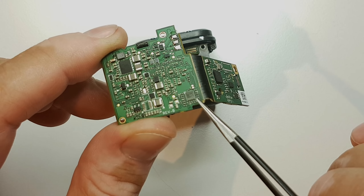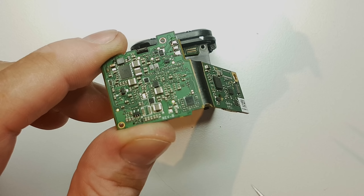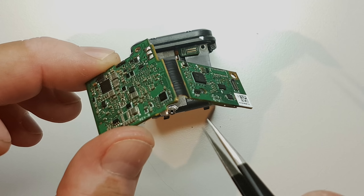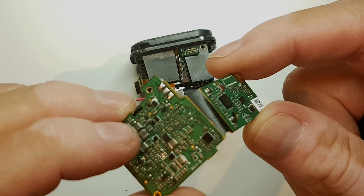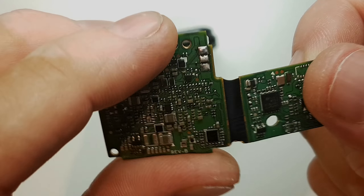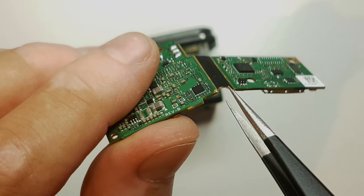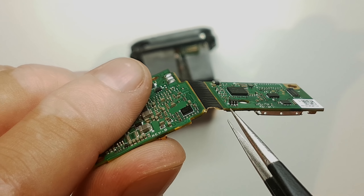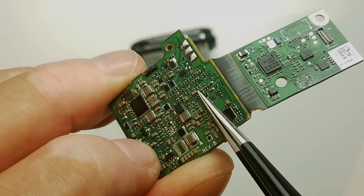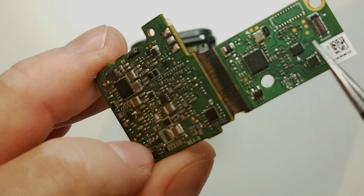But the only thing that was not broken or killed was my lucky part here. This one is actually a microprocessor which holds a secret source firmware that manages the securities and all the other things on the board. Another thing that was really killed in this board was this ribbon-style PCB here — you can see it's cracked and a part is missing. This ribbon cable is pressed down inside this PCB and there are a lot of little traces where signals from one PCB travel to the other. Here we have the Wi-Fi and Bluetooth section.